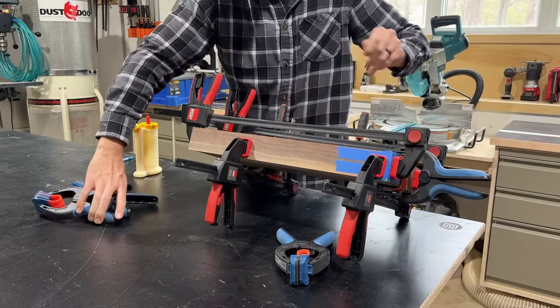Here you get a really good view of how that joinery all comes together and how strong this shelf is really going to be. It was a really simple setup — the shelf was incredibly easy to build, especially compared to my other version. I finished it by giving it a light sand. I want to warn you to be careful with the plywood veneer — I did end up sanding right through the veneer on one of these sides just because it is so thin. And here's a big reason why I think this is a far superior way to build floating shelves over a plywood miter fold: you have options with these front edges because you have real hardwood there. You can put a round-over on it, or if you wanted to get a little crazy, you can put a big heavy chamfer on it. As I finish off this chamfer, that really completes this build.